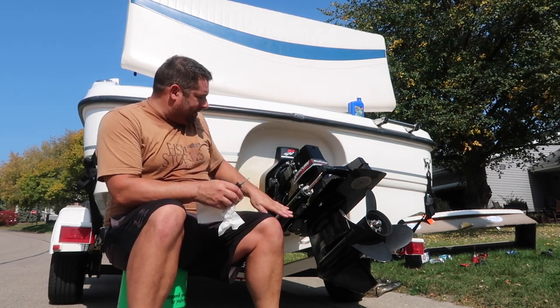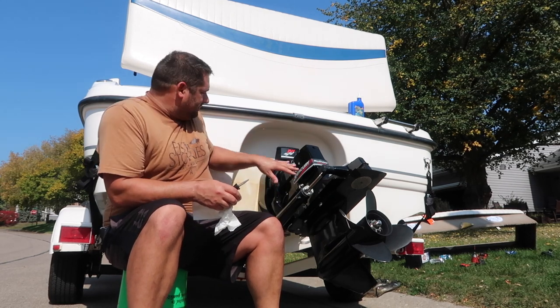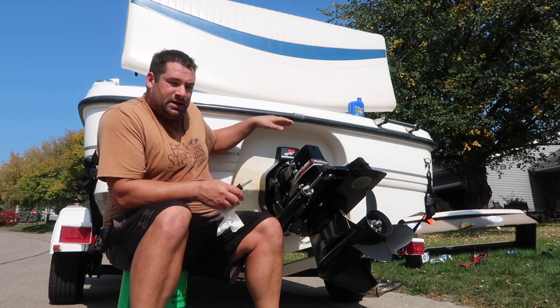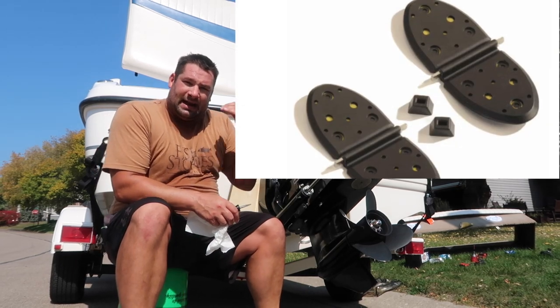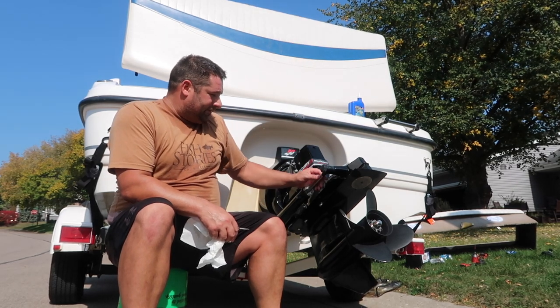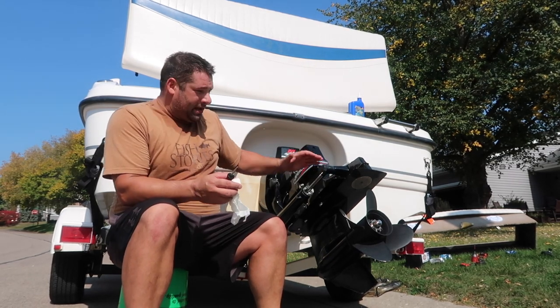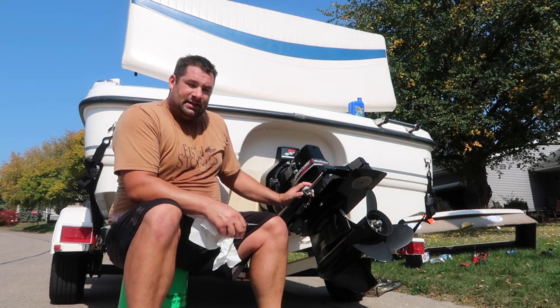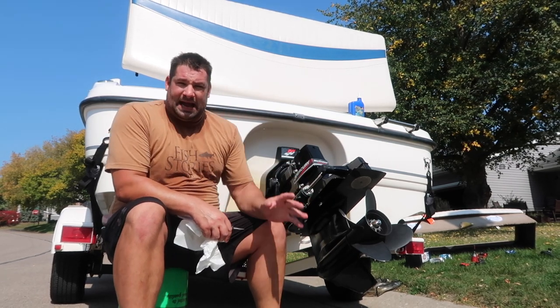What that prevents is — let's say you get a big wave splash and it comes up really high. The exhaust manifolds are about this high inside the boat. If the water goes up in there, it can hydro-lock your engine — the water goes into the motor. Or if you catch a big wave, or if you park your boat on a beach at an angle, that can also cause that. That's the importance of flappers.